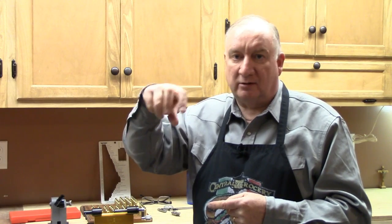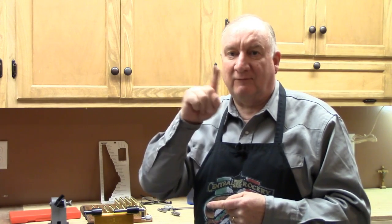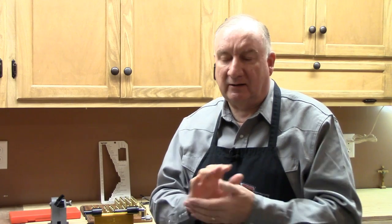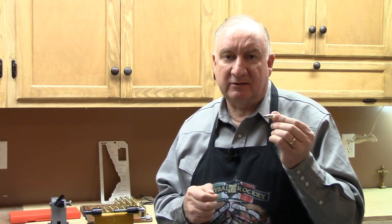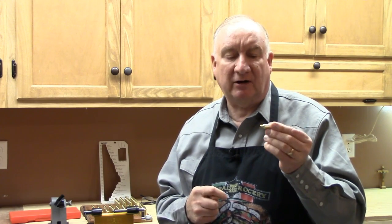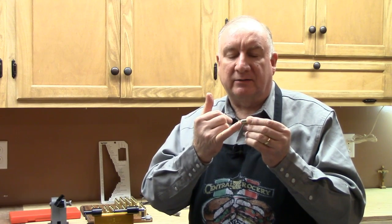You don't turn a turn at a time. You don't even turn a half a turn at a time. Think of a clock. You only turn from 12 o'clock to 1 o'clock at a time. That's all you do. In fact, it can be even less than that when you're approaching the final cutting amount. Never, if you're using cases for sporting rifles, for factory rifles, never ever cut more than the slimmest amount that's on the case.